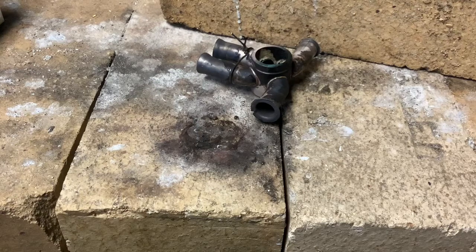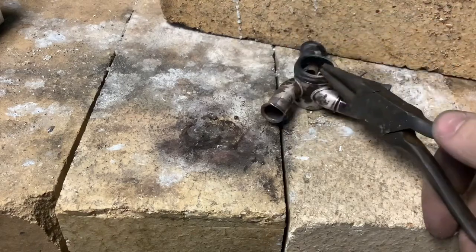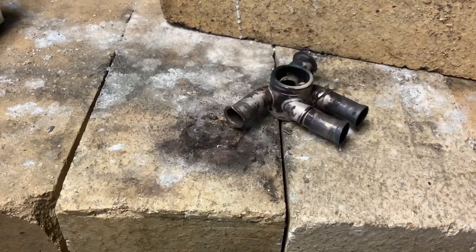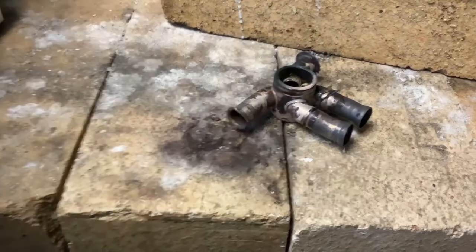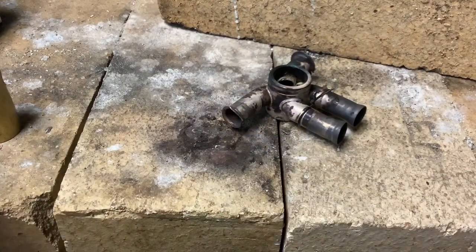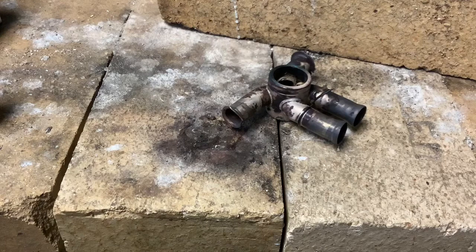This will go into a pickle and then we'll do the finish work on the lathe — cut the threads and clean up. The keen observer will notice there are no threads cut on the casing yet. I used to cut threads on the raw casing blanks, but a friend told me that his colleague had issues with that: once you braze it, the threads get burned even if you have a cap over them. So it's a bit of a pain threading right up against the knuckles afterward, but the threads come out really, really nice.